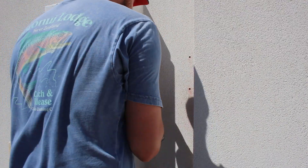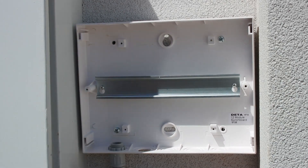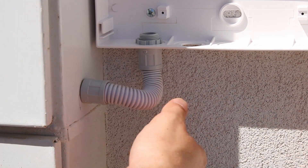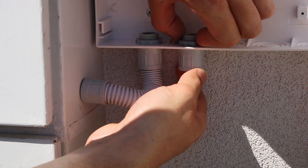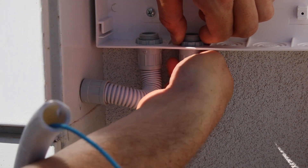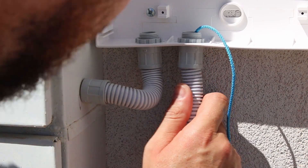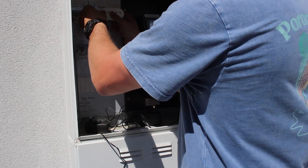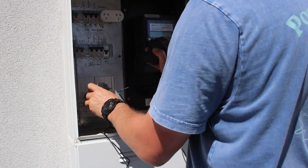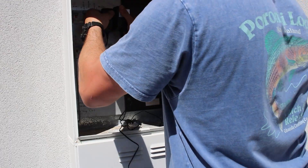This is where I mounted the controller — right next to my electrical switchboard and directly above the tap where the reticulation is connected. I used a small piece of flexible conduit between the controller and the switchboard to route my power supply cable in, and the conduit from under the retaining wall comes in through a second gland mounted into the housing. There's an existing socket in the switchboard I can use, and I installed two power supplies: a 12-volt DC supply to run the controller and a 24-volt AC supply to power the solenoid relays.